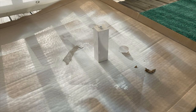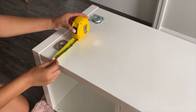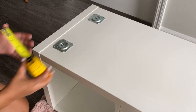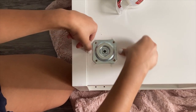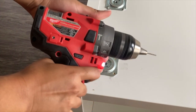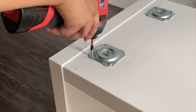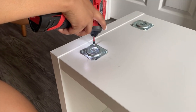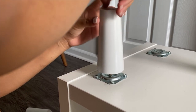I did about one to two coats and let it air dry overnight. Once your legs are dry, you're going to want to attach them to the TV stand. Start by measuring where you want the legs to go — I did two inches off either side on all four corners — then tape the leg plates down so they don't move. To make it easy to screw in the leg plates, do four pilot holes on all four corners of each plate, then go ahead and screw them in.